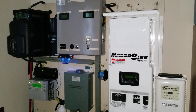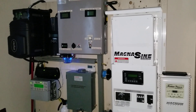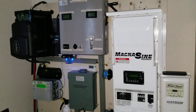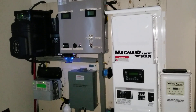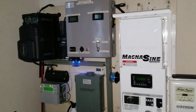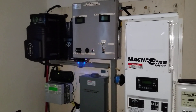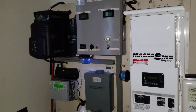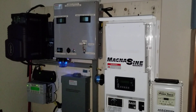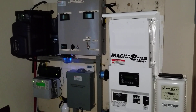What I'm going to do is tear up this entire board one step at a time, because I don't want to take everything down and be without power. I think I can just shut down the Outback and try to expand. When I shut down the Outback, I have to get rid of that box — the command center there — so I can add another backplate to carry the two inverters. I'm trying to improvise so I don't have to buy the other backplate designed for dual Magnum inverters.